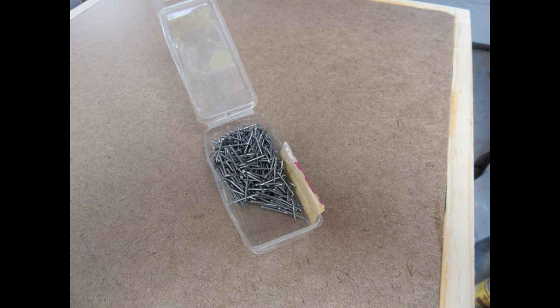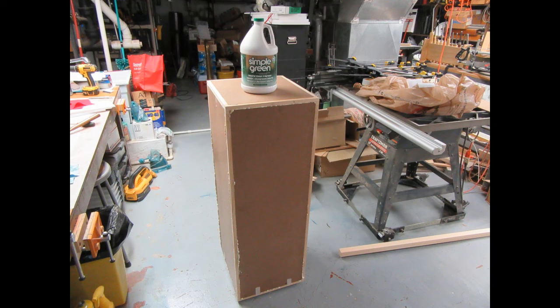So, even though the idea is to make the basic case box using only glue, in this instance I make an exception and have some brad nails on hand if needed to hold the end panels in place during gluing. Both end panels have been glued, and one end rests on the riser on the floor, while a heavy weight rests on the top end. Some brad nails were used where needed, when weight alone did not press the panels evenly into the inlay areas.